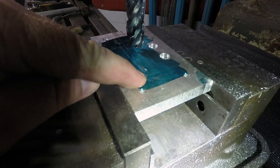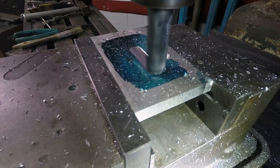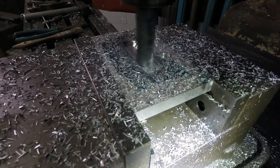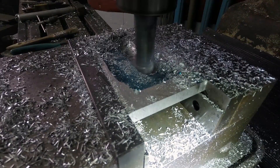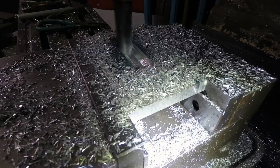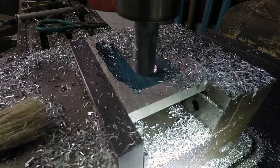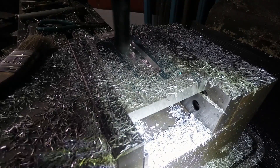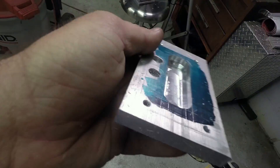I have some layout lines — I want to take an end mill and open up a cavity in here to house a couple of electronic components. I'm going to open it up three-eighths of an inch deep from the surface. This end mill is awesome at cutting on the sides but not as good cutting on the face, so I'll have to work it back and forth to get it in. It doesn't like contact on 180 degrees, but it gives a really nice radius profile once we get it in there. I'll come down the sides and clean it up — it gives a real nice looking cavity. It's got a real nice profile; this will be the bottom and this will be the top.